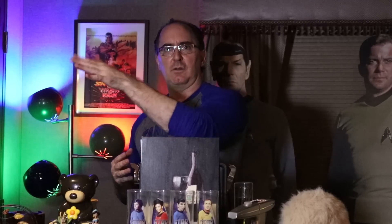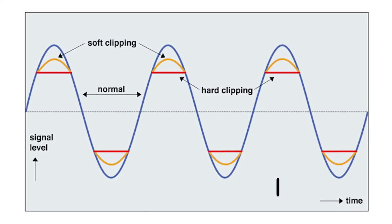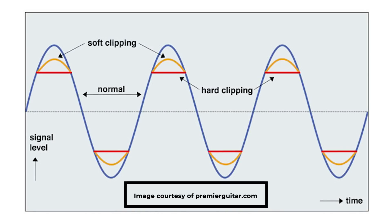The one thing I don't want you to do is overheat a product, and I don't want you to current limit either — because in some cases when you flip that switch to 4-ohms, that receiver is going to clip sooner. That nice sinusoidal music waveform is going to look more like a square wave. When you have a square wave with a long duty cycle, you could fry a tweeter, because that tweeter is basically seeing DC voltage.